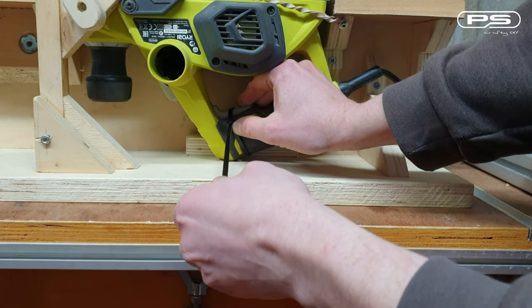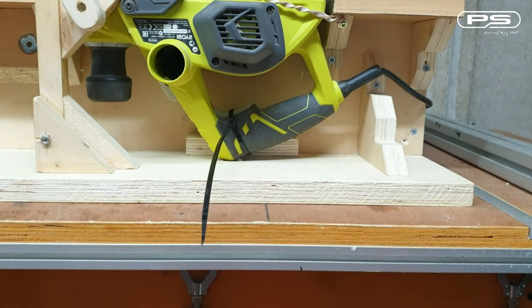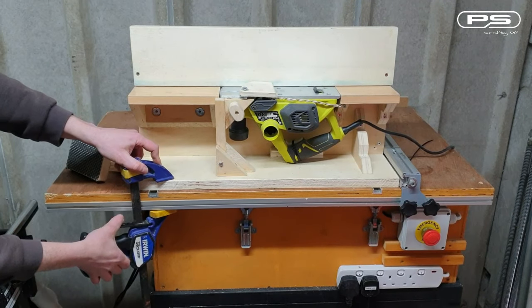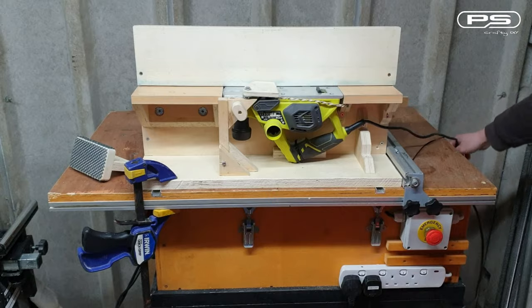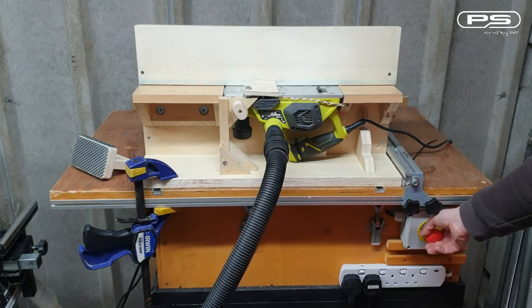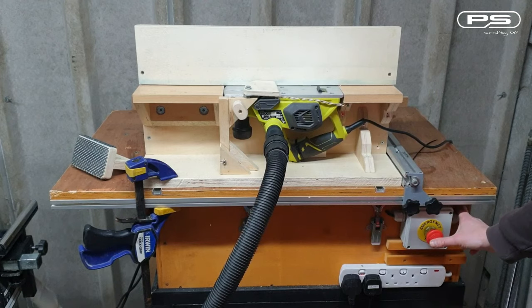To keep the trigger on I will fit a tie-up. To keep things safe, I set my jointer onto my table saw against the fence and clamp it down in place. I connect dust extraction and my jointer to an individually switched socket block wired through an emergency stop — simply hit the stop and the planer shuts down, no messing about.